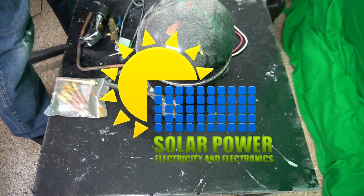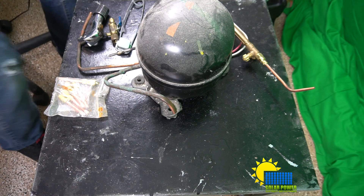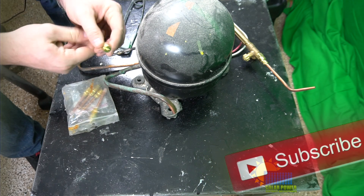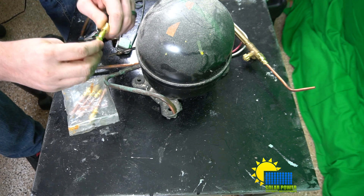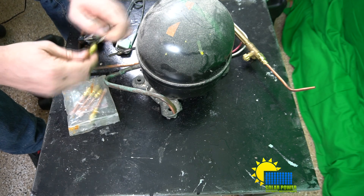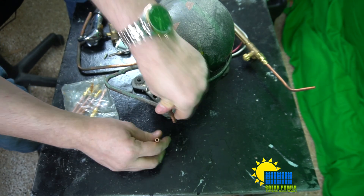What's up ladies and gentlemen, YouTube, everybody out there — it's Philip with Solar Power Electricity and Electronics. What I've got for you today is an old air compressor made out of an old refrigerator compressor. These things actually work in reverse too, so if you needed a vacuum pump and didn't need anything super special, you could use an old refrigerator compressor to make a substantially moderate vacuum pump that is acceptable.